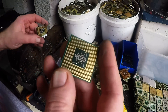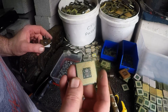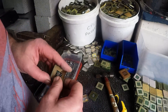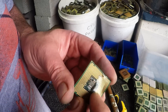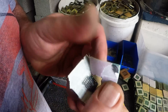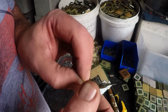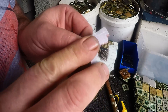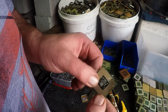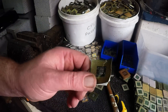With these pinless CPUs, as I said you should be able to sell most of them. The ones that don't sell, or ones you get too many of that don't seem to sell, you scrap them out. If you pick up PCs off the street that have been sitting in the rain there's a good chance they're going to be faulty, so in that case I don't try and sell them. With the gold pads it's very fine gold plating - very light. Here I've split open one of the fibers to show you inside that there's no gold bonding wire or anything like that - just these pads that sort of go straight through the board, it looks like there's copper pins in there. Unlike the old style ceramic CPUs where you've got bonding wire and all kinds of things, these ones don't have much, so they're very low value in gold.